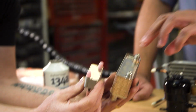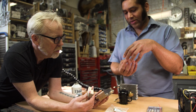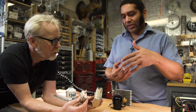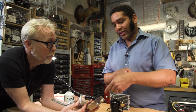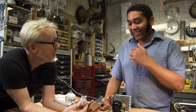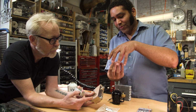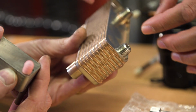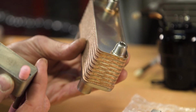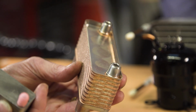Yep. And this heat exchanger is a stack of steel plates with some ridges on them, and those steel plates are pressed together, put in a furnace, and then the furnace brazes. Almost like surface mount electronics. Almost exactly. And in that stack, you can see these formed channels, and this bottom plate is a pan, all the rest of these plates have that same pan feature. And so you stack all the pans up, and the pans alternate refrigerant, water, refrigerant, water, refrigerant, water.